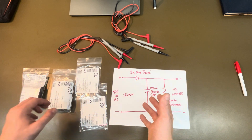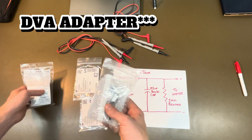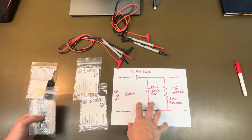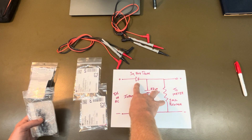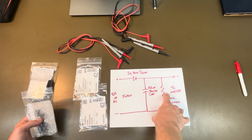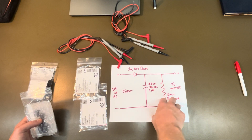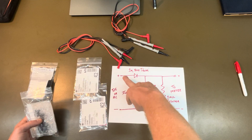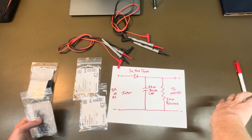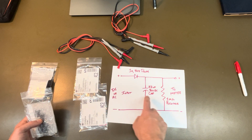Rather than buying a DVA sensor, I decided to make everything more complicated. I started looking at the components and how they're actually built, and it's extremely simple. It's a simple circuit with a diode, a capacitor, and a discharge resistor — a one megaohm resistor tied across both poles, a 22 microfarad capacitor, and a diode. The meter gets connected on DC because you have a diode, so you're reading DC voltage.